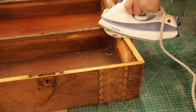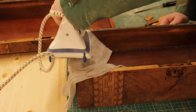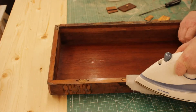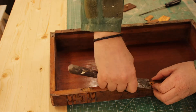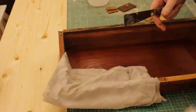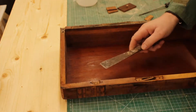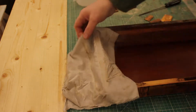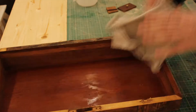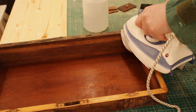What didn't click with me was there isn't any strip on the back edge of the box. So I'll continue to save these pieces ready to put back. With these old boxes and old furniture they used animal glue, and under heat this becomes soft again — that's why it's easy to get the edging off and any other veneer. Using a wet towel or cloth makes the heat penetrate more quickly.